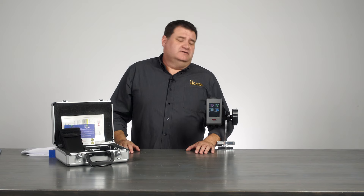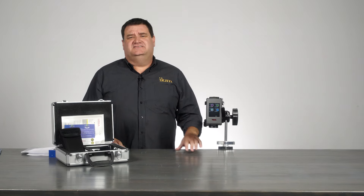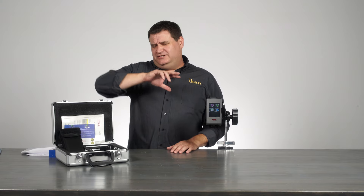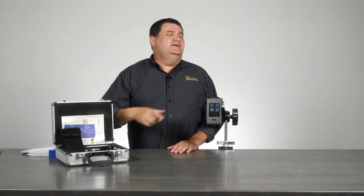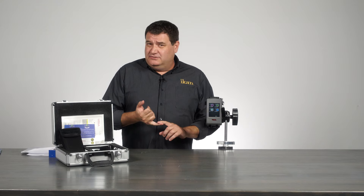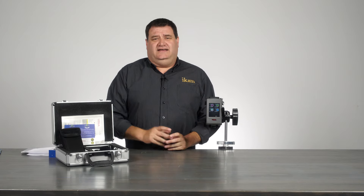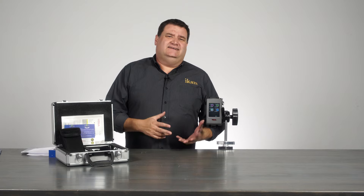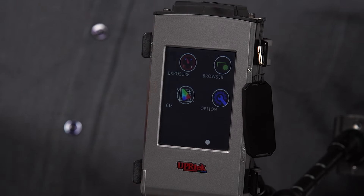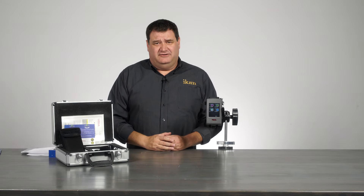The browser allows you to control whatever SDHC card you put inside. With the CV600 you can insert an SDHC class 10 card and record the readings you're taking. If you're measuring multiple lights on set, you can record those readings and review them later. You can save the spectrum, your basic list, the CIE charts — and then export all that numerical data directly into an Excel spreadsheet once you put the card in your computer.